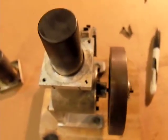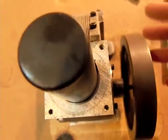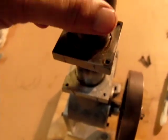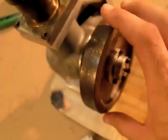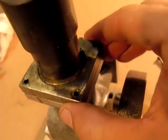So what I did was I took some super glue and put it down in there and it worked really well — there's no way I can get that off now. I'm going to put this on there and see if we actually get our compression back. I've got to line those lines up. There is virtually no gap between the displacer and the actual outer bore, and it comes right to that edge. When we put this cap over it, I'm going to spin it and put it on there and you'll see it come to a stop — just from that gasket doing its magic. Still in good shape actually, so that's a good thing. That's what you want to look for with a powerful engine like this — you don't want it to spin freely, you want it to have this effect. You can hear it kind of farting. So I'm going to tighten these back down and hopefully we can get this out and test it.